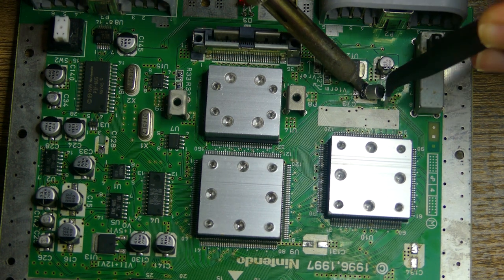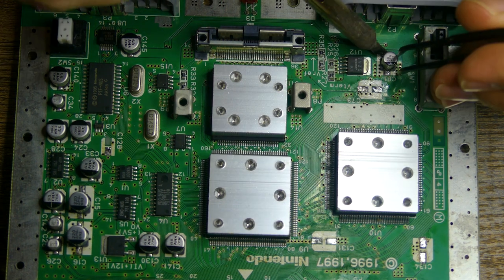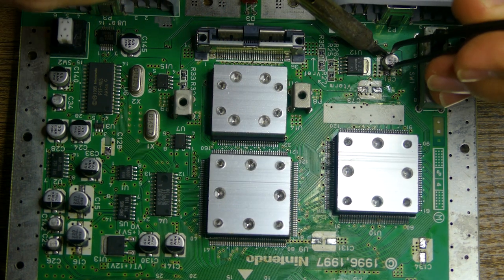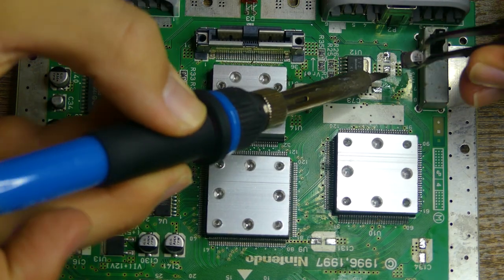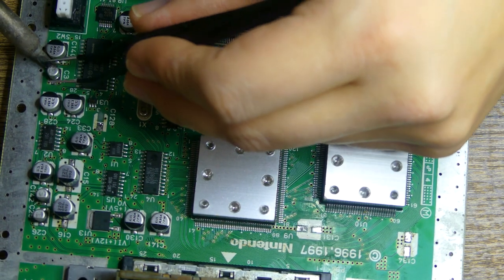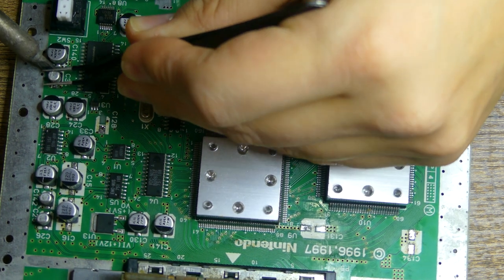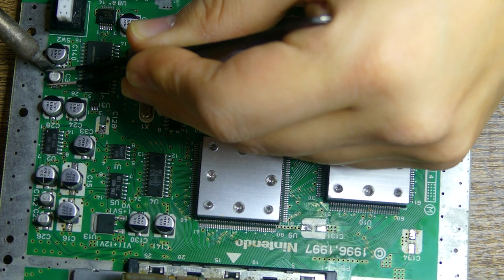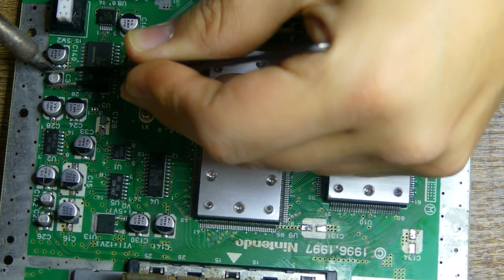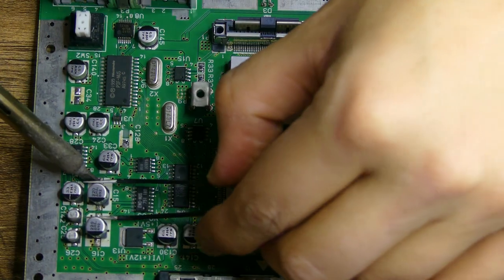I put together the kit for the components from AliExpress just to have more caps in case I need more. You can easily get a capacitor replacement kit from console5.com. I've used their kit for my other N64 and it fit the bill perfectly. The repair I'm most concerned about is the ripped pad for C128. With a little patience, damage like this is completely avoidable and you won't need to worry about damaging a board. Luckily, the schematic for the N64 is available, which I'll have linked in the description.